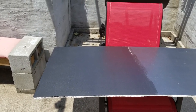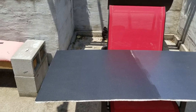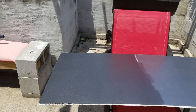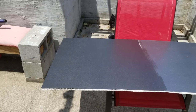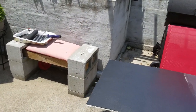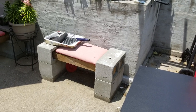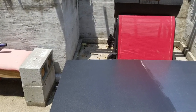As it cures, it'll get just a slight shade darker — not extremely darker, but just a little bit darker. The reason it dries very quickly is because it has a semi-transparent nature. This is front and rear projection material, but you notice that just two coats — actually the first coat — pretty much covered a piece of drywall. It does what it does extremely well. It's been designed to roll extremely well, even in harsh environments. I know folks would tell you not to use a foam roller, but a foam roller is really the best for application if you know how to use them. If not, I'd recommend staying with a quarter-inch synthetic nap and doing it in light coats — two light coats and it should come out very, very well.